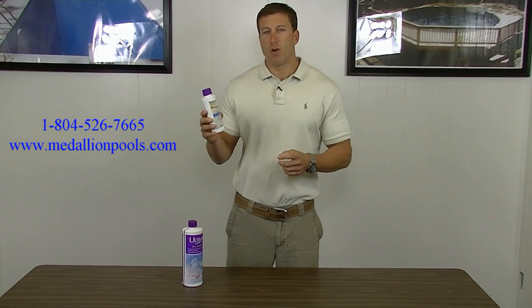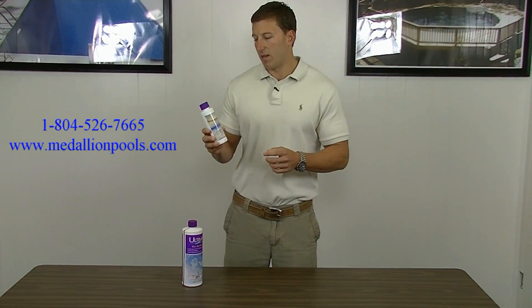You take the cell off the pool, add this product to four to five gallons of water, and basically you want to clean the fins — the actual fins that are in the cell itself. You'll actually see scale and calcium build up flake off. That's what this product is designed to do.